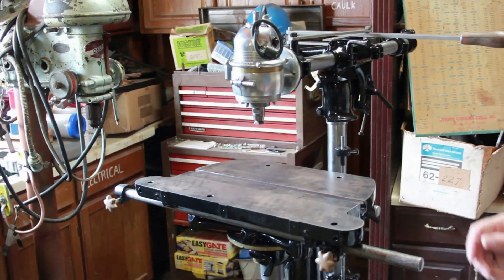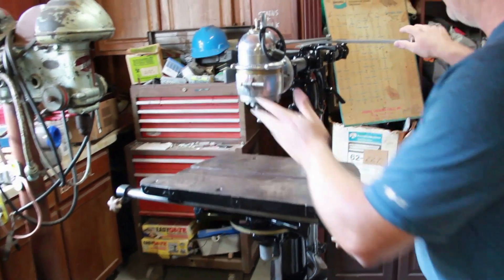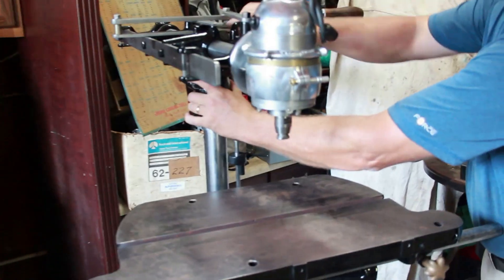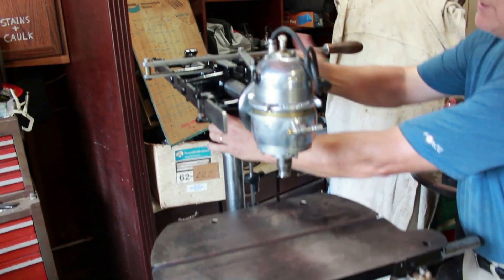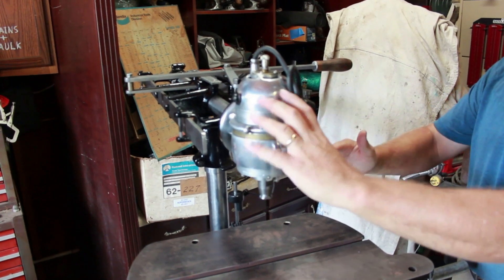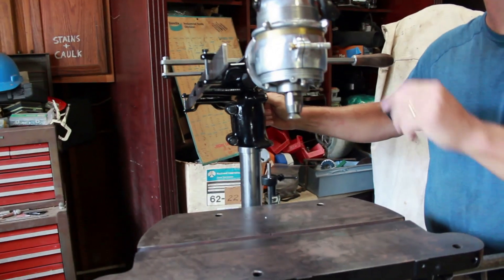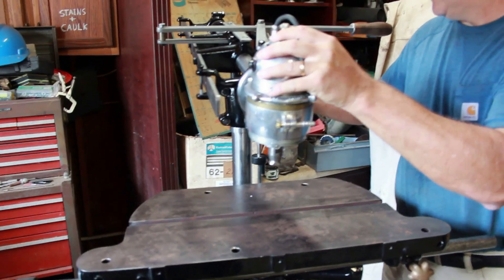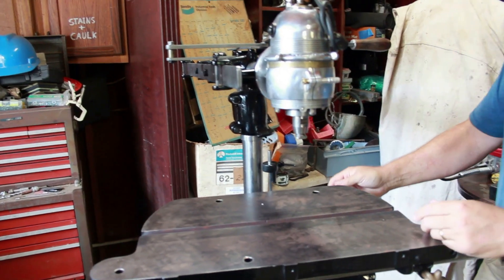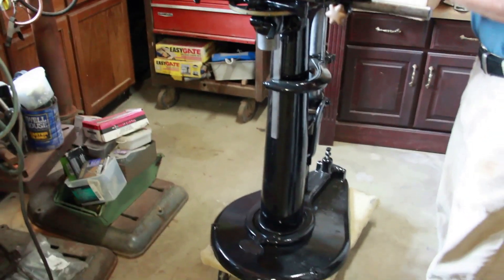There are multiple features. Normally the head's not clamped down, but when you clamp the head down, you loosen this and it actually slides in and out — so the head can slide in and out. The head can tilt this way, and also if you loosen this, the head tilts in both directions. There is a stop for that. It also has a foot pedal so the entire head can go up and down, to be used like a pin router.